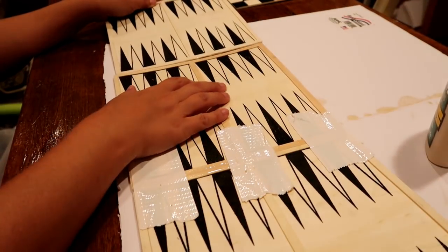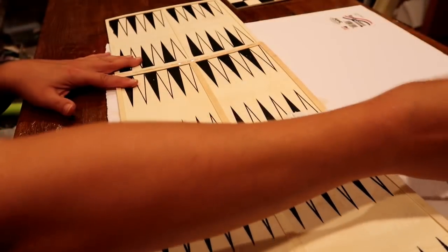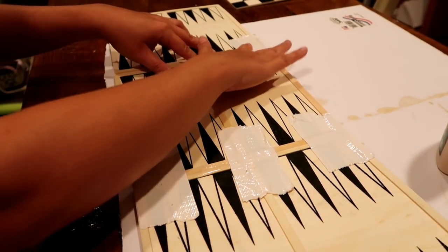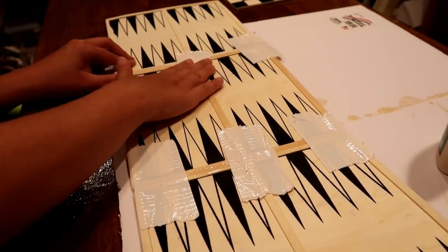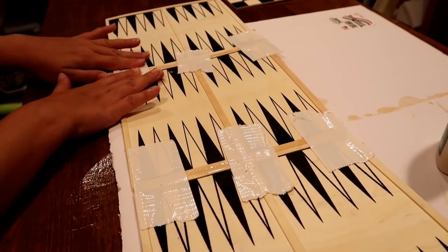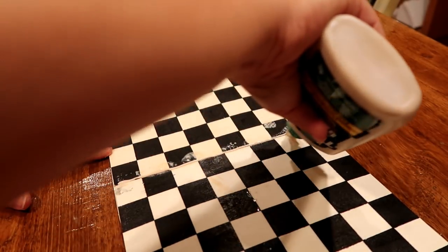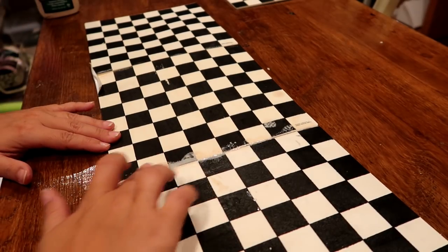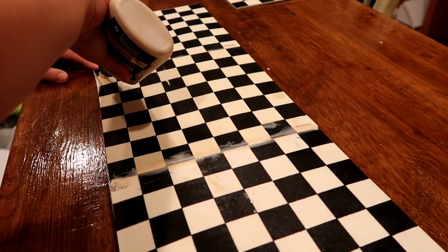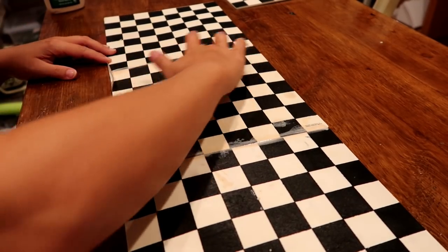Now I'm going to attach one more wood piece so that they are three boards tall. On these boards there's one side that is completely smooth and the other side is a little bit raised, so I'm putting the glue and the tape on the side that is raised. I'm going to repeat this process with the other nine pieces until I have three pieces that each have three boards attached. I'll flip my board over and add a little bit more glue to the back side — that's the side I'll end up painting.